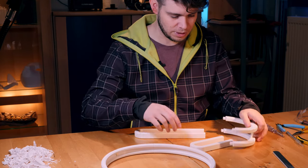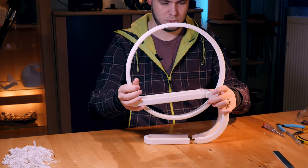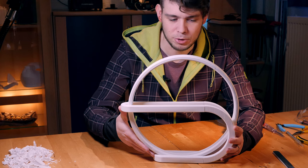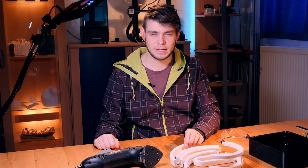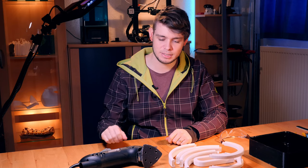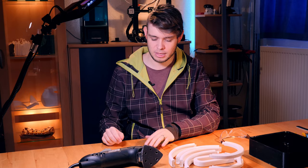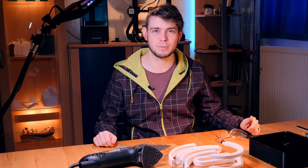Let's see how the rest of this fits together. When sanding 3D prints, I prefer powered tools — of course you can do it by hand, but it's a lot faster with a powered sander. Start with something coarse like 80-grit sandpaper and then work your way up to very fine, possibly even adding some water to the very fine grits for the best results. And wear protection.